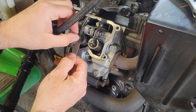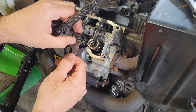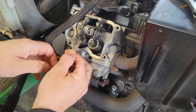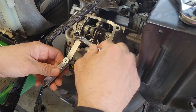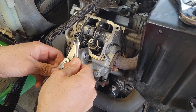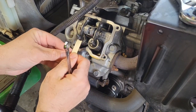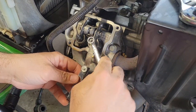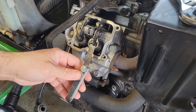So now we have our 0.010. We have to keep loosening. Now I can get this underneath there — I want just a little drag on it. We're going to tighten that up. Same thing over here — loosen that up, do it so there's drag. Now here's the thing: when you go to tighten this, sometimes when you tighten it, it moves and it tightens to the point where you lose that gap.